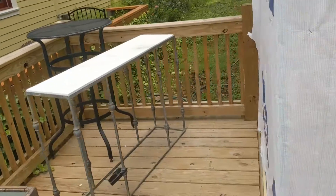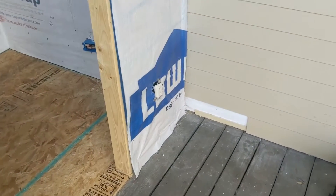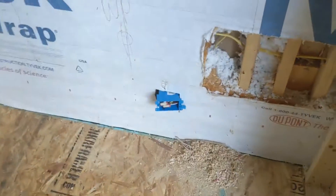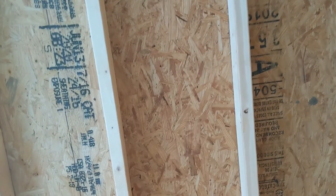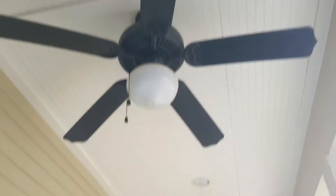All right, we got the house wrap on all the way around — that was from last week. The electrician's done, he's got his rough-in inspection complete. This used to be the only external outlet; now we just tapped one off over here. There's supposed to be an art light up here, the fan's been taken out, and there's going to be two can lights. There's going to be a window here of 32 by 36, and there will be switches — one for your outside lights and one for the lights in this room — and a switch for these two.